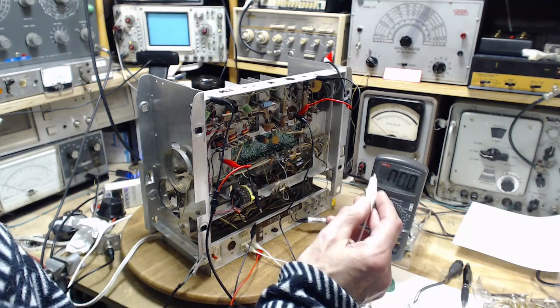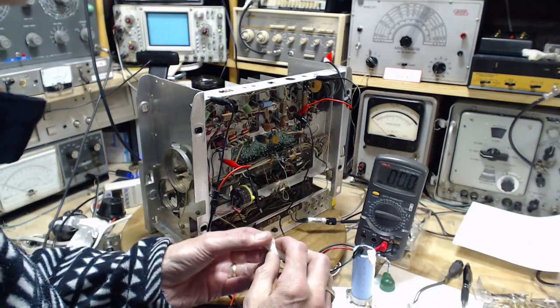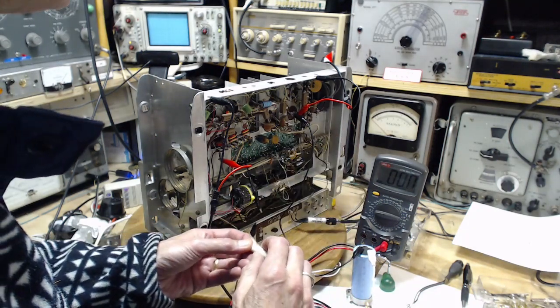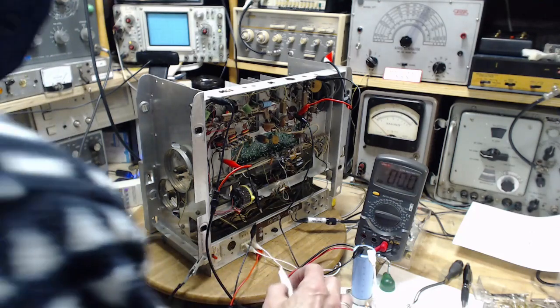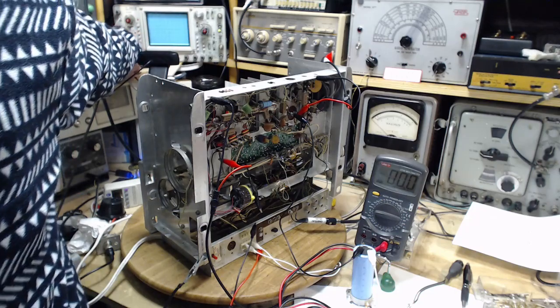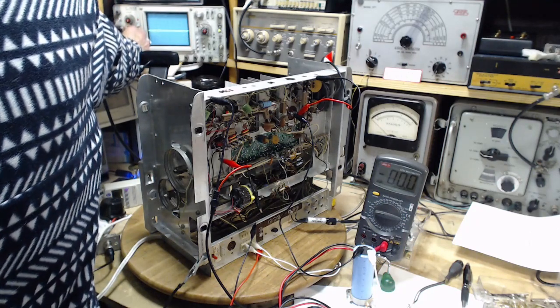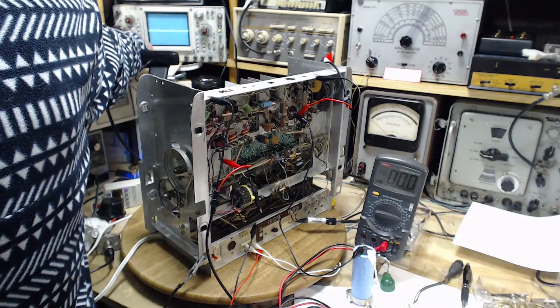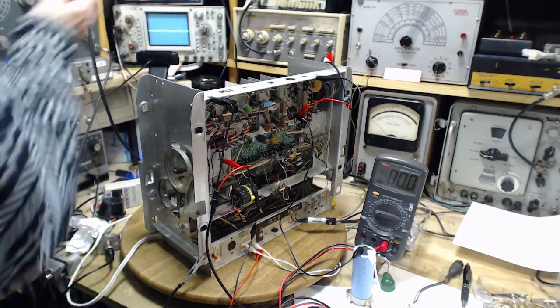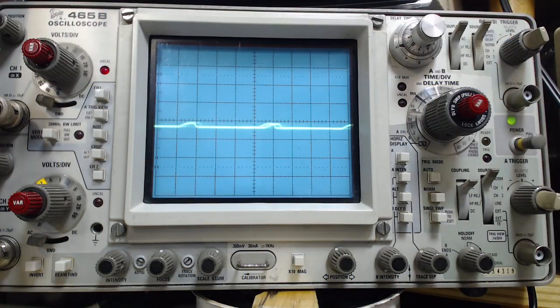So now we want to make and break this connection, but this fair size capacitor is going to be sparky. So I don't want to do that. Instead, what we're going to do is first flip this to AC here. Put it up on the screen, and then we're going to magnify it until we can see what's there. And then I'm going to flip cameras so you can see too.